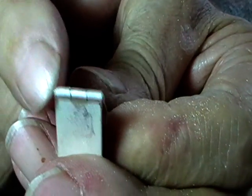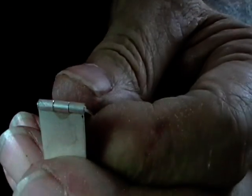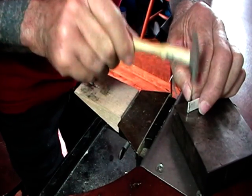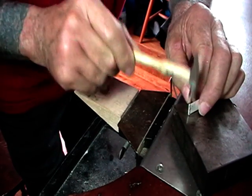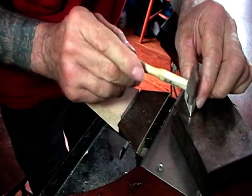And we're going to just lightly hammer the ends of this. On your bench block, with the little riveting hammer, I'm just going around this way on the end of the rivet. Turn it over to make sure that you have it sticking through the other side.